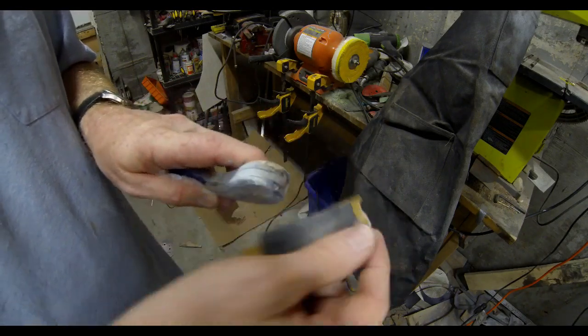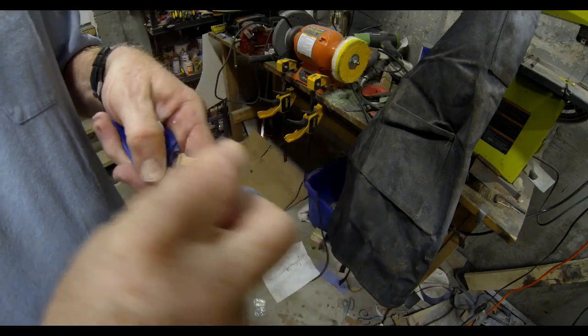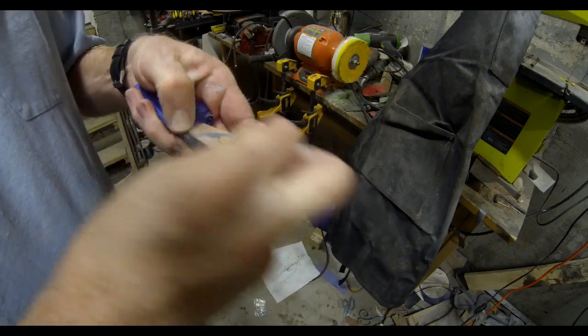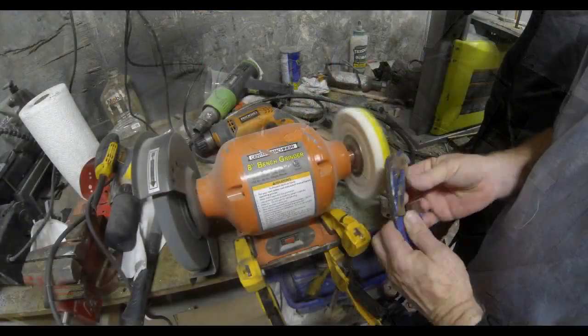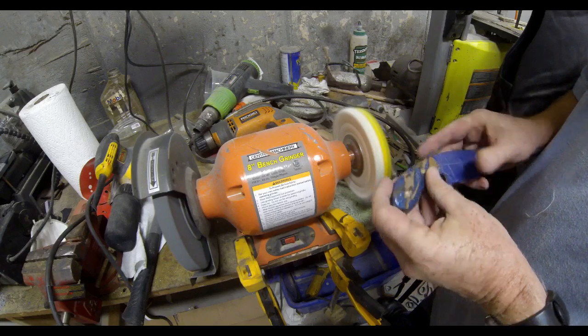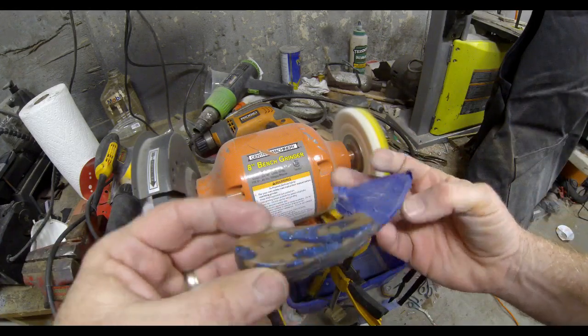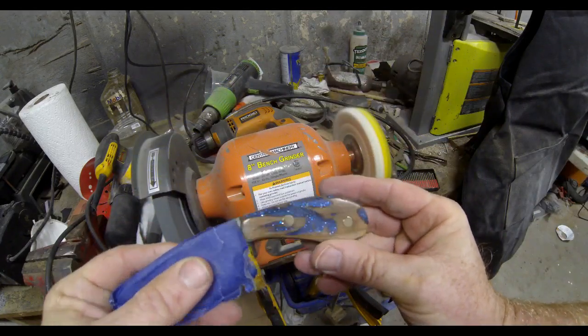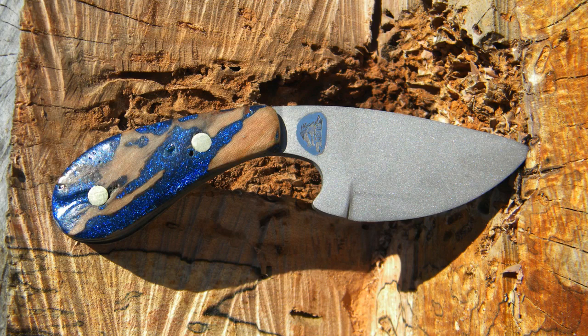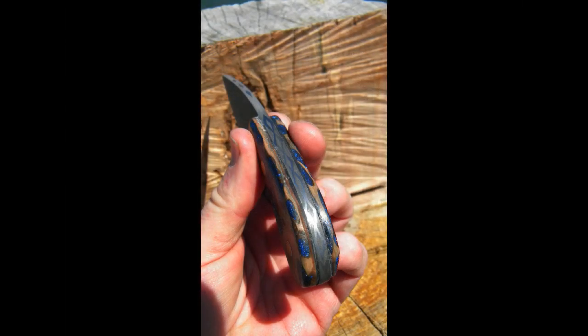Now that the epoxy is dry, I'm just doing a little finish sanding — I sanded with a 400 and then an 800 grit sandpaper, and then I put it on the buffing wheel and just buffed out a shine. This was actually a very simple little knife to make. It was made from a 1095 high carbon steel blank, available on the web at diyeasycrafts.com. The blade has a dull matte glass bead finish, and the scales are made from a hybrid wood and fiberglass resin. Very simple, very easy project, with a unique design in the spine also created with the glass bead machine.